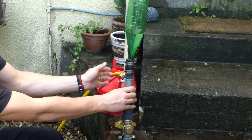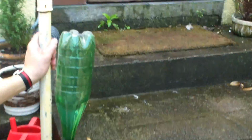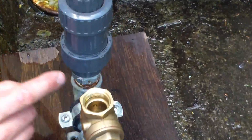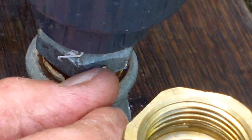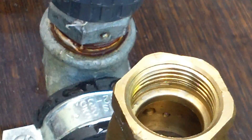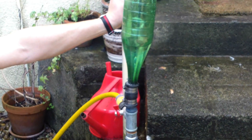You've got a tap up here, and then this is happening over and over again. This is a very important part just here — this is a little tiny drilled hole just below the non-return valve. It's got to be below the non-return valve. This is your snifter valve. A tiny drilled hole — it's got a little pin in it just to stop it getting blocked up with debris from the stream. This sucks in a small amount of air which keeps this from getting waterlogged, so it sucks a little bit of air in on each stroke.